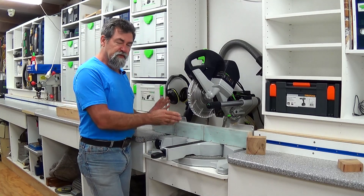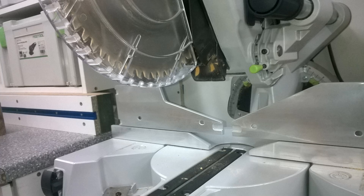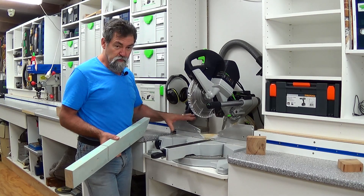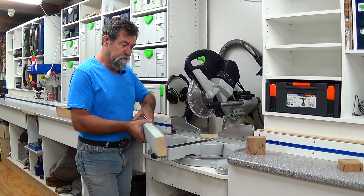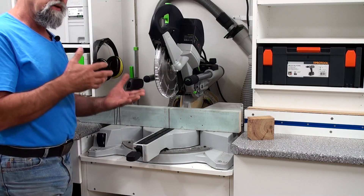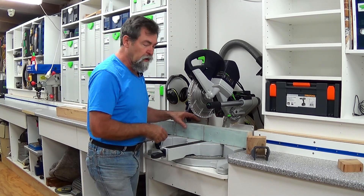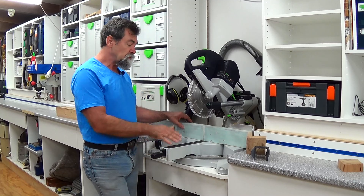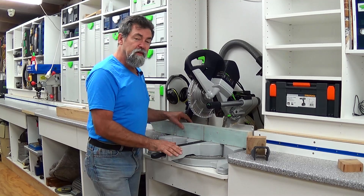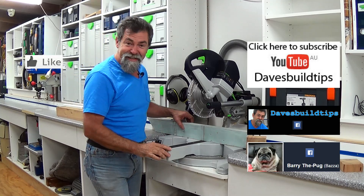The safe way to do it is to use another clamp or use double-sided tape to lock it all on. I think that using a sacrificial fence is going to give you a much neater cut than what you're normally given. It doesn't have to be this tall, and if you're cutting narrower stuff you can leave the extra dust collection rubberized port on there as well. So make yourself a sacrificial fence, get super clean cuts, and every now and then a little bit of extra depth if you need it. Thanks for watching, see you next time.